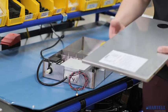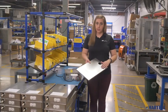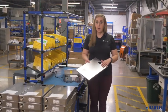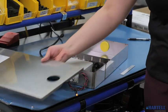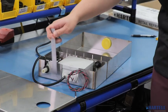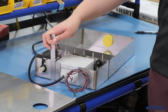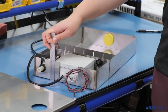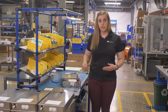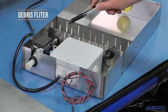The HCP pump is constructed of high-quality 304 stainless steel with a 2B finish. The easily removable lid allows for access to the reservoir, pump, and control compartment. The H1 version has a low profile of only 2.4 inches or 60 millimeters with a 1-gallon or 4-liter reservoir, with both top and side condensate drain inlets. Another feature of the HCP pump is the specially designed debris filter.